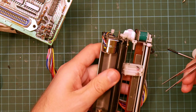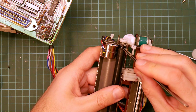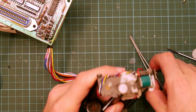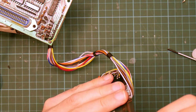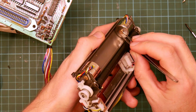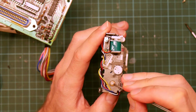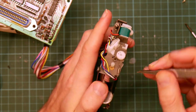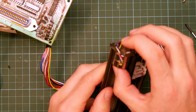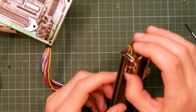Incidentally, I figured out what the clicking noise as the thing rotates is. There are fine teeth in the roller here that grip the paper, and it's bumping over this thing. So that's actually all as intended. There's a brass bearing here, and I bet there's one sticking out the other side. The position is such that the only way to get it out is to move it this way — to get the bearing out from underneath this — but I can't do that because it's wedged under there.